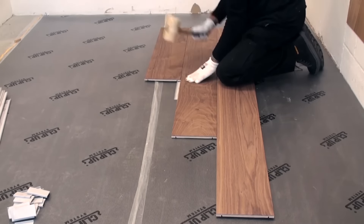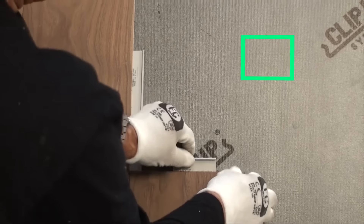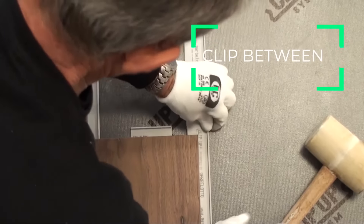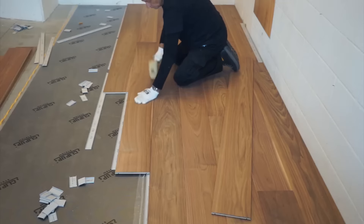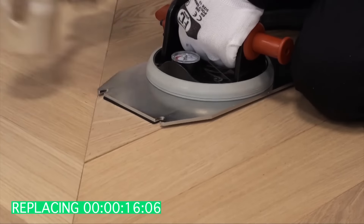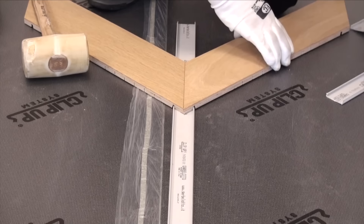The installation process involves placing clips onto the subfloor, which securely anchor the parquet boards with special milling. The flooring becomes immediately walkable after installation, allowing rooms to be furnished promptly. The clip-up system accommodates various thicknesses, widths and lengths of parquet boards. Using stainless steel clips, the boards are effortlessly attached to the subfloor with a simple pressure mechanism. Removal is convenient, requiring only a small screw for the initial board and no holes for subsequent ones.